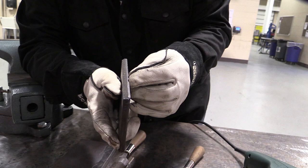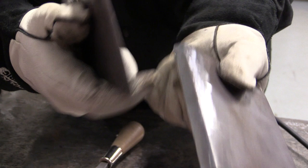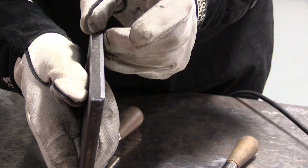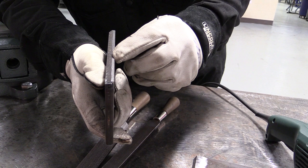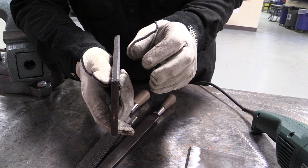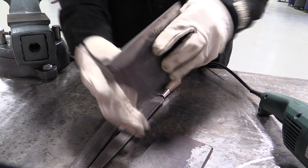This root face is basically a heat control mechanism. If we have one with a root face and one with no root face, the edge without the root face is going to burn off way faster. The general rule with a root face is the size will be determined by your welding procedure, but generally the size of the root face should equal the size of the gap. So if you're using an 1/8 inch root face, you use an 1/8 inch gap. Sometimes we use an 1/8 inch root face with a 3/32 gap, or a 3/32 root face with a 1/16 gap. It just depends, but the root faces are put on the same way — and that's what we're going to show you today.